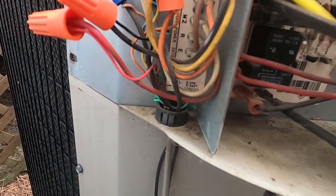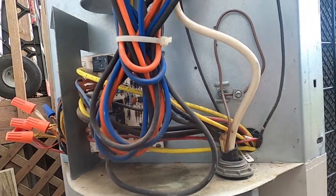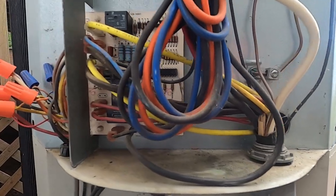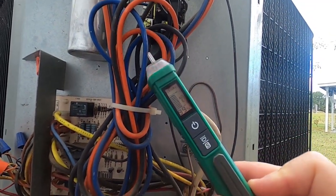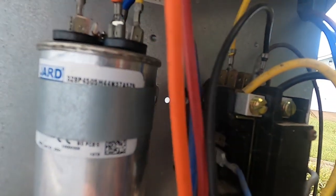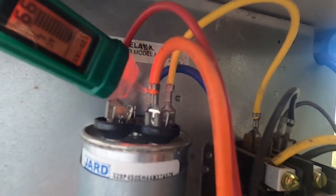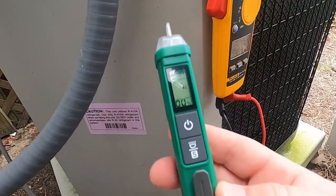Getting down on the board — at the stake-on for the R0 wire where it connects to the defrost board, it's picking up low voltage. For ten dollars, that's probably not a bad tool. You pay sixteen to twenty dollars for the Flukes and other cheaper ones, and this isn't that bad. Up where the common connects to the capacitor it picks up too. For ten dollars, that's not a bad deal.